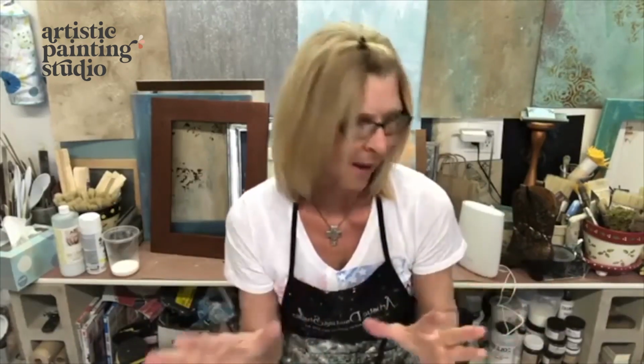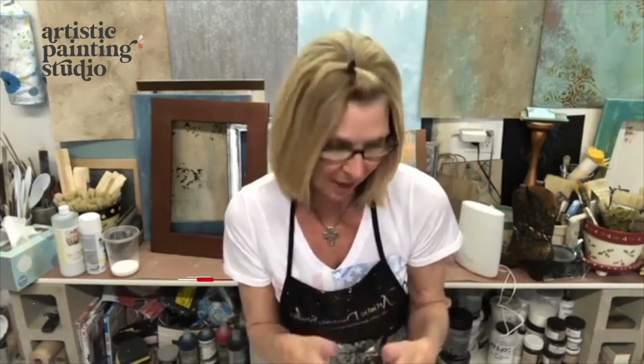And because this is something that I'm doing as a wall hanging and, you know, just going to be putting it on our wall, I'm probably not going to bother to top coat it, okay? It'll be fine just as it is. Now, if it was a piece of furniture and it's something that's going to be touched and used on a regular basis, then I would put a top coat to protect it. But a glaze on its own has a little bit of durability. I mean, it's enough durability for this project, as well as glaze would be enough durability normally for even a wall finish.